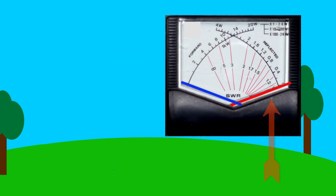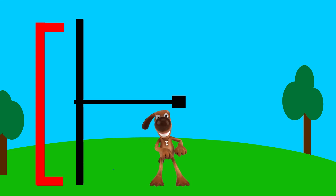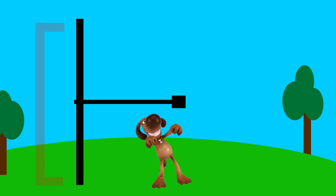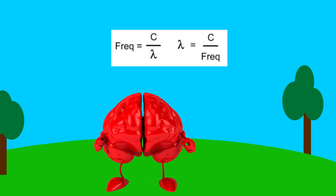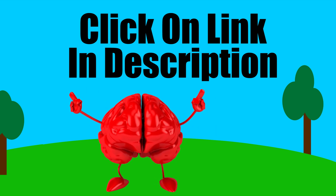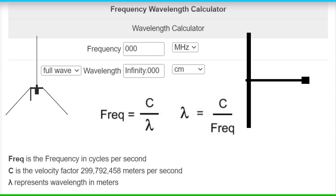That means making this needle go as low as you can. The antenna needs to have the right length to match the wavelength of the transmitter signal. This is worked out with this equation, but instead of stretching your brain, simply click on the link in the description for the frequency wavelength calculator. This is to calculate a quarter wavelength, which is the standard length of a half-wave dipole and a quarter-wave antenna radiator.